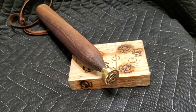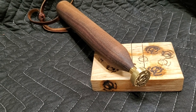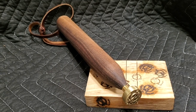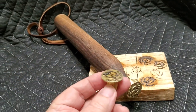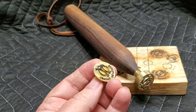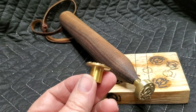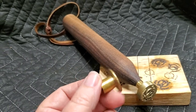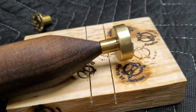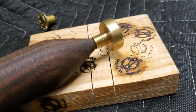And I'll show you in Aspire how I took the vectors, did a mirror image of them, and exported out for a tool path. It took quite a while. Had 10 different versions of it, and finally got one that looked good and was quality work. Of course, by the time I got cutting it 10 times, there wasn't much left to it, so I went with a new blank. And again, that's 1-inch brass, drilled and tapped for 1/4-20.